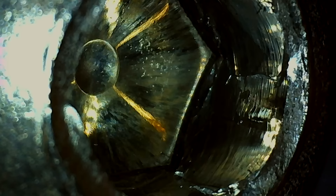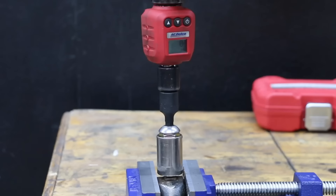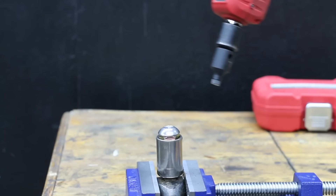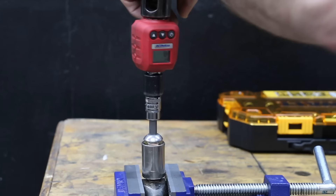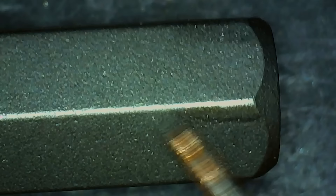And the Husky destroyed the bolt. The very high torque load did cause some wear and tear to the Husky. The Mixpower claims to be made of impact-grade chrome moly steel, but unfortunately it couldn't handle the power and snapped at 1,032 inch pounds — that's a lot of damage. The DeWalt is off to a much better start this round, finally losing grip at 1,351 inch pounds to move into second place behind the Husky, with no visible damage.